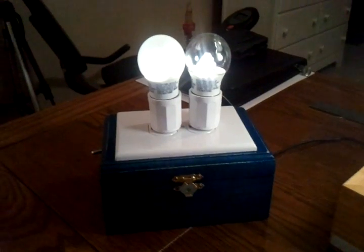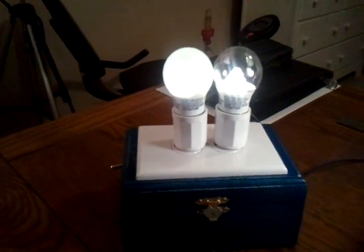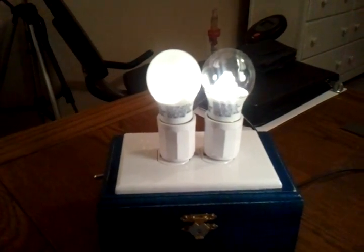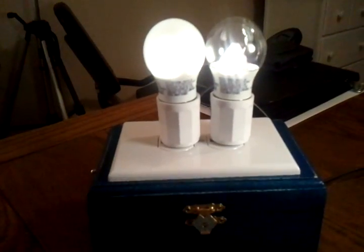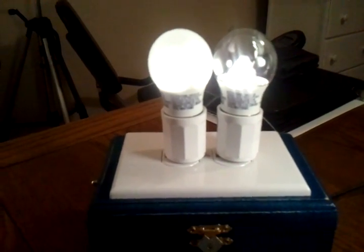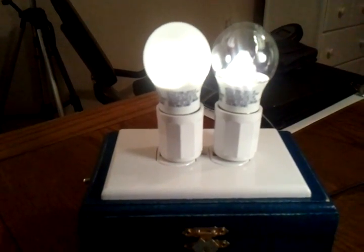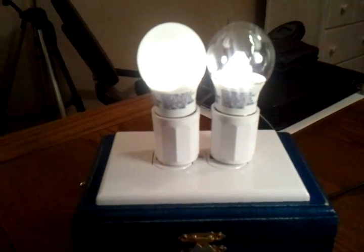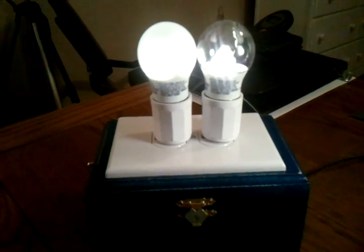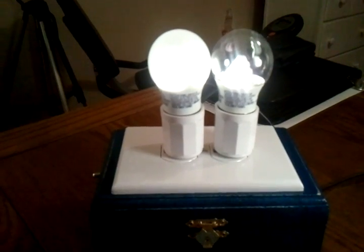This second one is the circuit posted in Part 7. My initial goal was to run it around 50 milliamps, but to get the kind of light I wanted, I went ahead and bumped it up to 80. You can see it's driving those two LEDs really well. I messed around with the resistor and capacitor, tried different values — the only difference from the posted circuit is I'm using a 3.3K resistor and a 1.0UF capacitor.